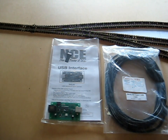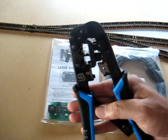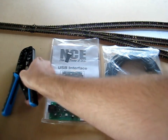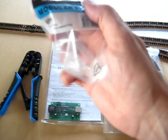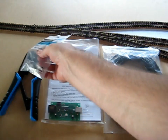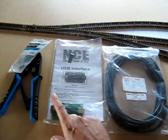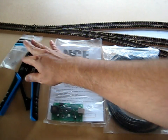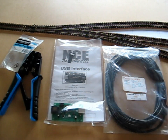I've also got a pair of crimpers for crimping RJ11 and RJ12 type plugs, and also some little telephone type plugs to go with the crimpers. The cable that goes into the USB interface and into the power panel — I'm going to make up my own custom cable. That's why I bought these crimpers. The cables are slightly different from a telephone cable, and we'll take a closer look at why they're different.